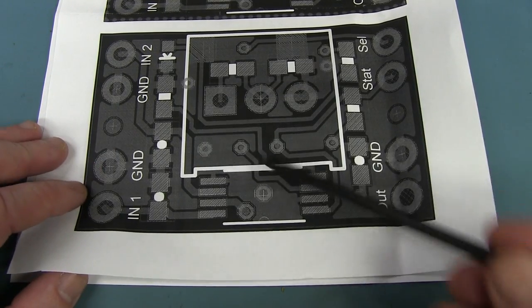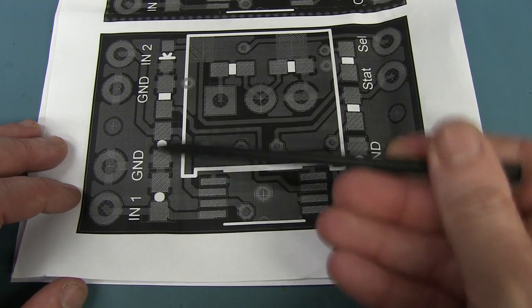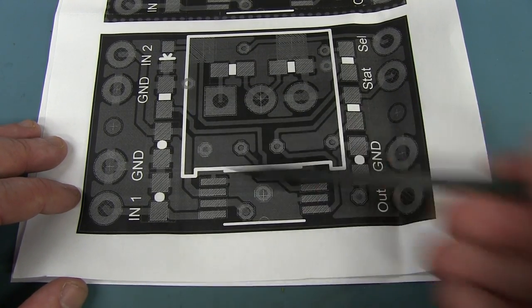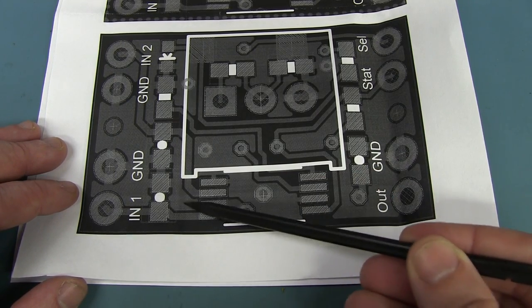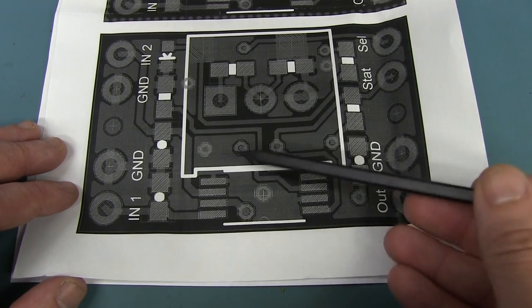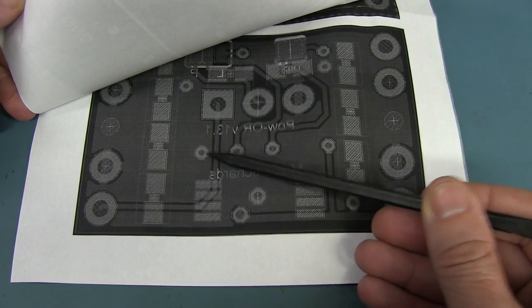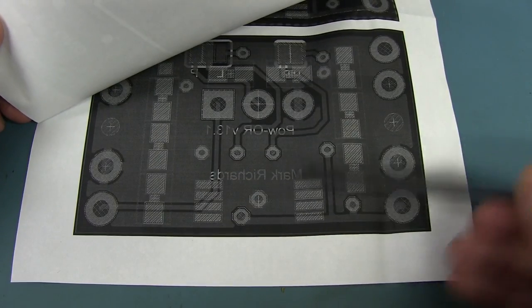And something that I immediately always look for on designs like this is, do you have enough via stitching in here to get your ground coupling over? Because your current is not flowing through here at all. It just stops. That's just some flood fill. So you have flood fill. This is not bad. Basically, you've got your ground coming across here, going up through one via there and jumping across to another via down in there.